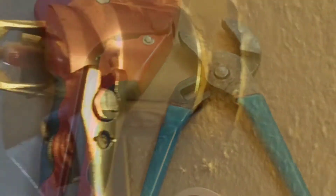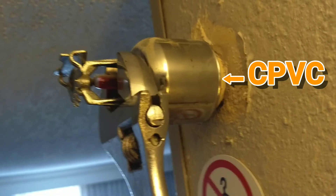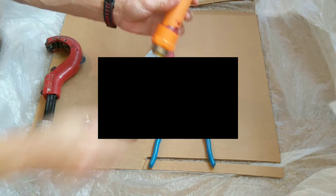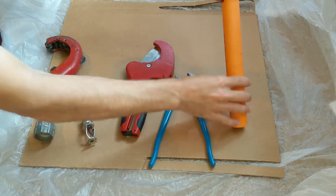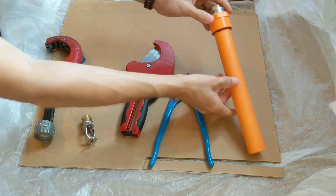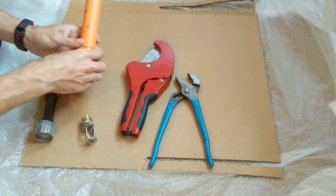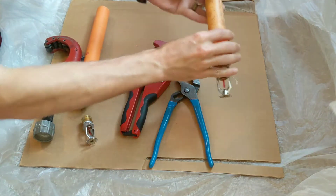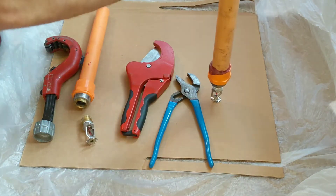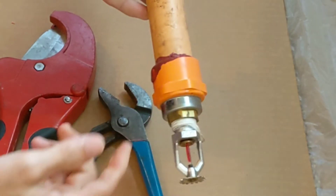If it's in the wall like this one, yeah, it's gonna break off. I have a drop here that I made up, and when I put my bell on with the glue, I held it up so the glue would run down my drop and not into my head and threads. A lot of times installers hurry up, glue everything in, put your head in, put your drop in, and all that glue runs down into the sprinkler head.